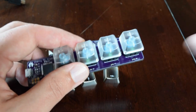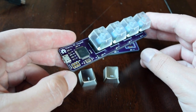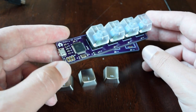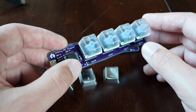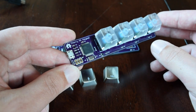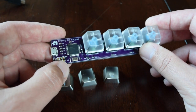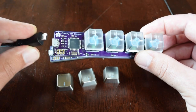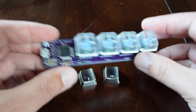After you get your board fully assembled, you're going to need to load the bootloader, so you'll need a programmer for that — something like an Atmel ICE or a USB Tiny ISP. Connect that to the programming port and flash the bootloader to the ATmega32U4. You can do that right from the Arduino IDE. After that, you will not need the programmer again — you only need it that first time to flash the bootloader. After that, you just plug it in via USB to your computer, which is how you program it and how you use and power it.